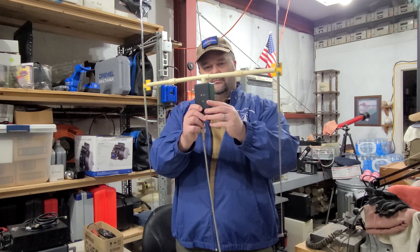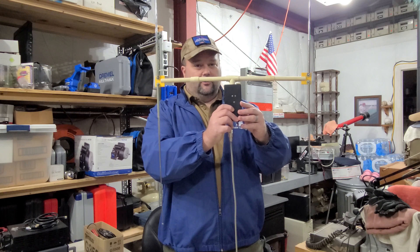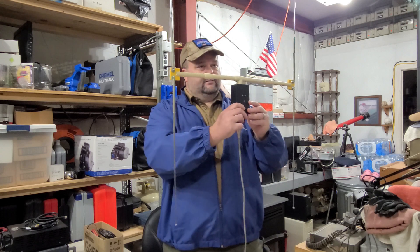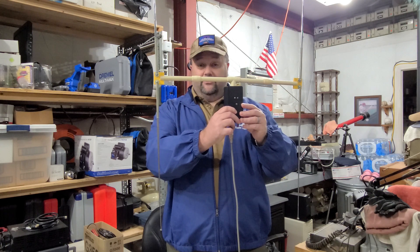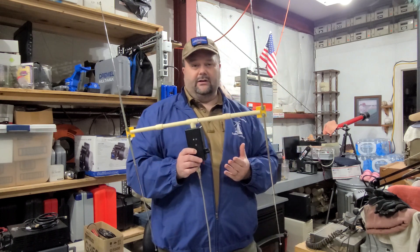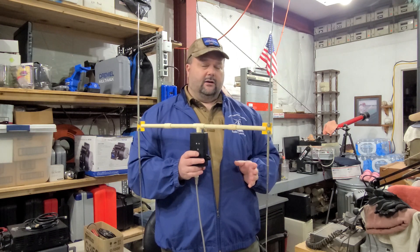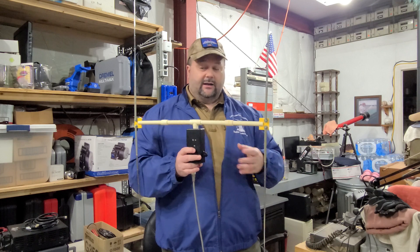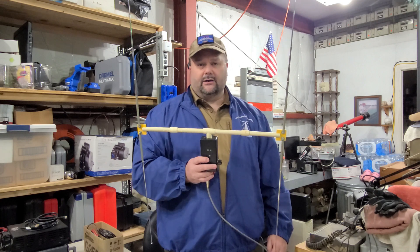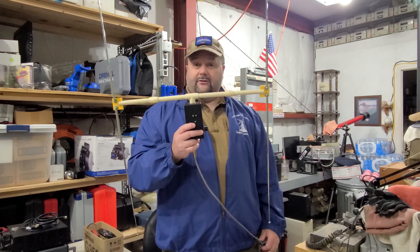Running a test on the Rainbow Kits SDF-1 — when you hear that tone go away and coming back into the studio, it dropped out completely. You can see there, it is really a very directional antenna. Especially if you had a group of two or three people, you could really triangulate on something very easily. And if portable in the field, this is powered off just a 9-volt, and of course you could have your handy talkie or mobile units in your vehicle and track down a source very easily.